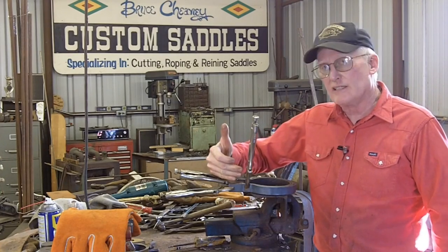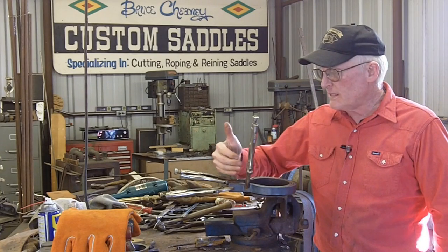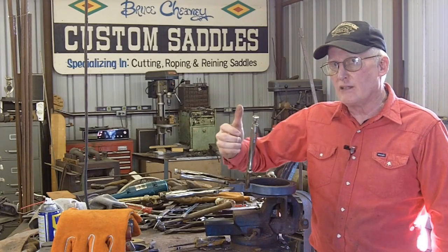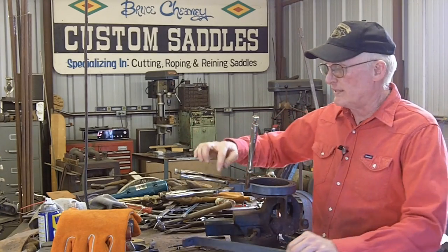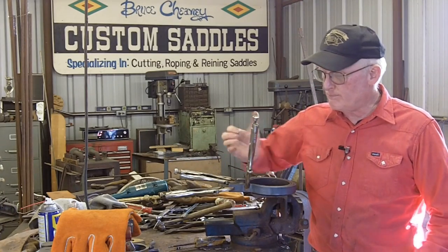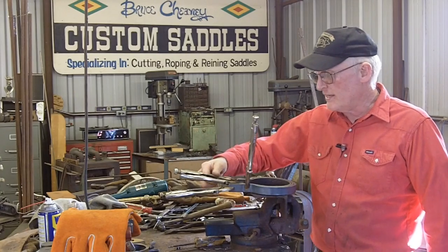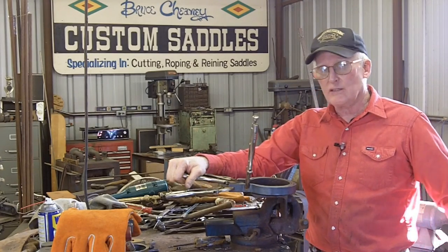When I get to the very end and bend it as far as I can, I stop for a minute and let it cool off. Then approximately half to five-eighths above where the bend is, I put a bend on it. Let that cool down just a little bit with vise grips on the end, then once cooled I bend it back the other way. I can heat that area and bring it up flush, clamp it down, let it set about 30 seconds, then quench it in water.